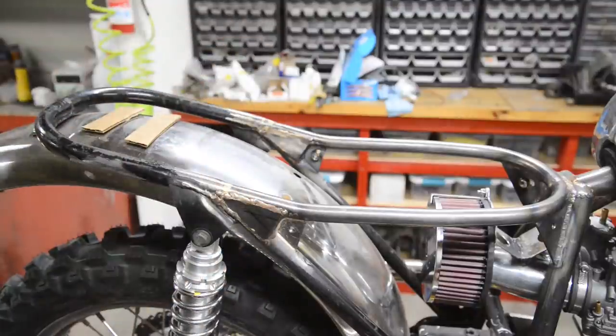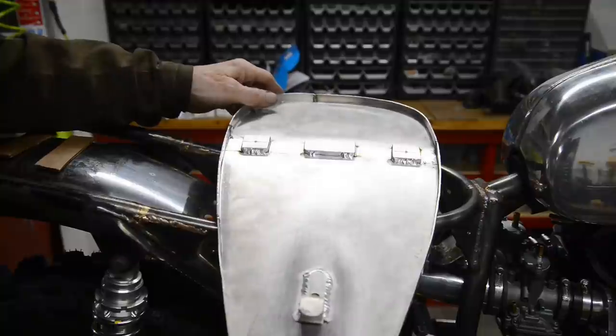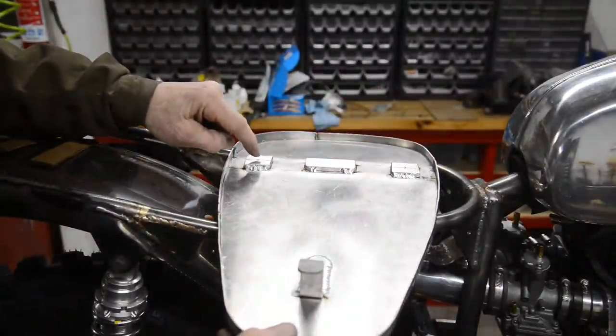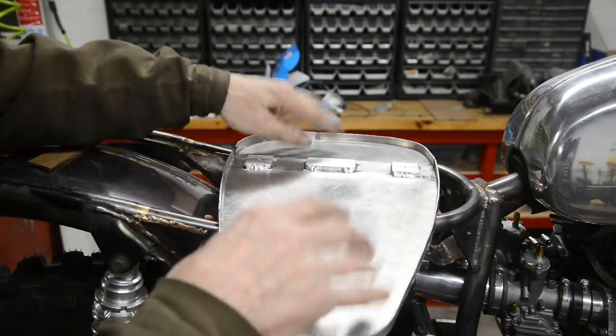So let me get welding some aluminium, or aluminium alloy, or aluminum, or any number of terms that I don't want you to get worried about. That's the pieces welded on. So these two, I've got a drill. What I'm going to do is drill them to the tapping size. And then when I've got the cross piece on, we'll put this on.